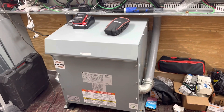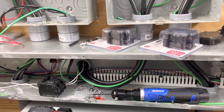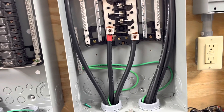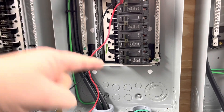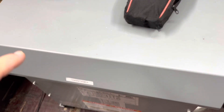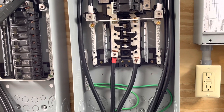I'm going to go ahead and disconnect the wiring because I have to rewire to my manual transfer switch on the outside. Right now, this is the wire going to the manual transfer switch and it comes out of here. I've got to rewire this because the way this was fed was the Growatts came into this panel into these breakers — that was my feed in. And then this breaker was my feed out with 240 volts to the transformer. Then on the secondary side of the transformer, I came up to the line side of this breaker here, and then this fed back out to the transfer switch. That's going to change.